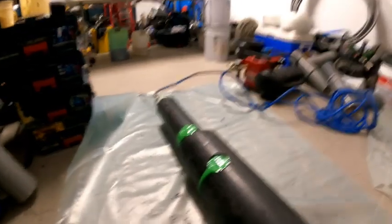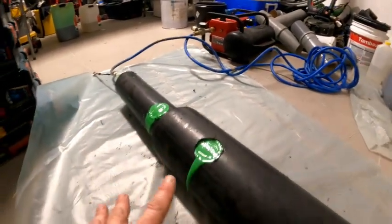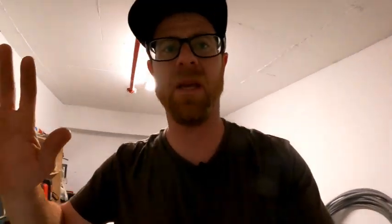Once in position, inflate to maximum pressure. This packer's maximum is 2.5 bar, and as you can see it packed out very nicely — you can see the resin oozing out. A safety reminder: balloons can pop and things can happen, so always keep a safe distance. Don't stand directly in front or behind it, especially in a manhole. Don't put your eyes right up against the opening — use a camera to look inside instead.